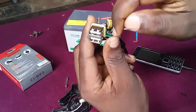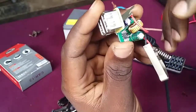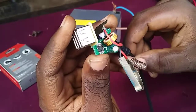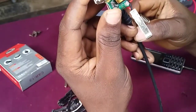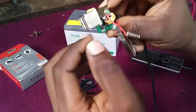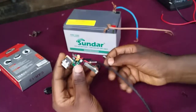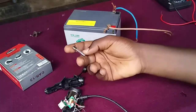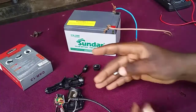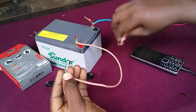It is this IC circuit here — it's written 'HC' something, but I can't even read it because of the smoke. There's a lot of smoke covering whatever was written on it, so I can't identify which IC that is. I feel very frustrated having a device like this where the fuse didn't blow but the integrated circuit did. To finish this off, I'm going to blow up this fuse — it's useless right now anyway.